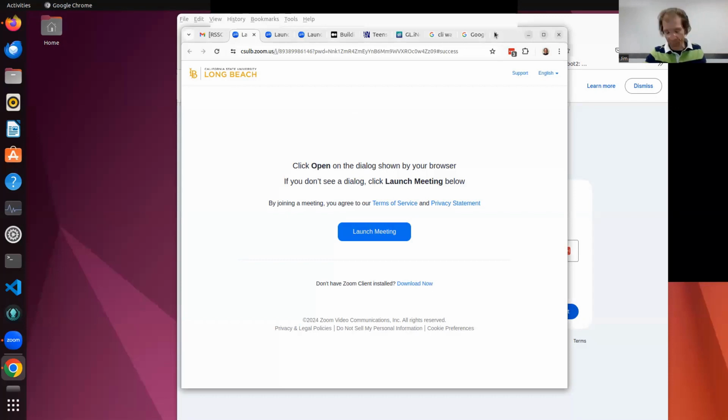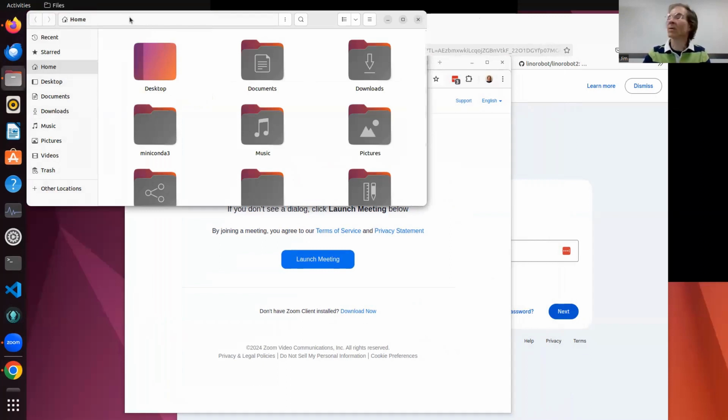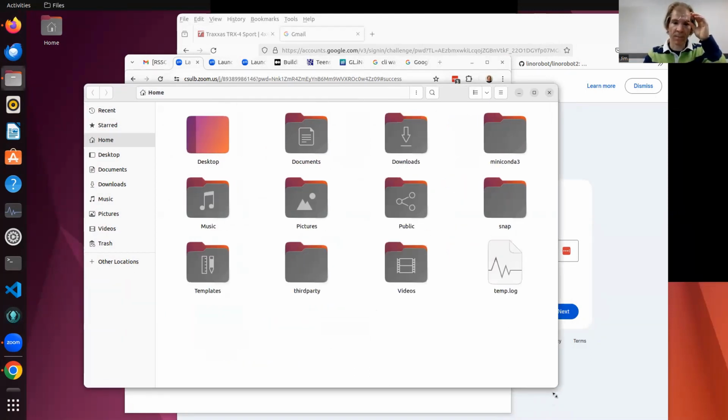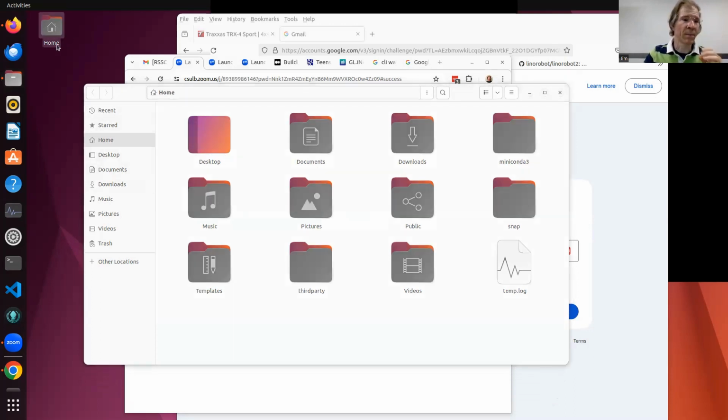The Teensy has many hardware level interrupts. I found this code online, and I have a bunch of links. I'll share later, but I can show you one or two of them now. With a hardware interrupt, it's a real-time analysis of the incoming signal and real-time sending out, so there's no noticeable human time delay at all. The PWM is going at 100 hertz, which is pretty slow, and the microcontroller is 600 megahertz. The Teensy is very powerful. I wouldn't use an Arduino Uno on something like this.